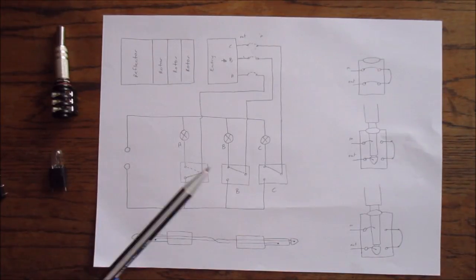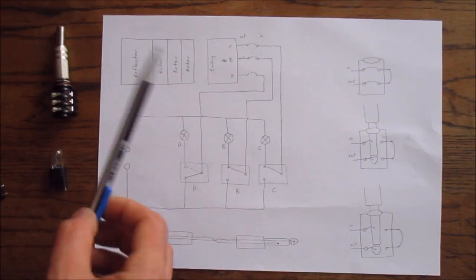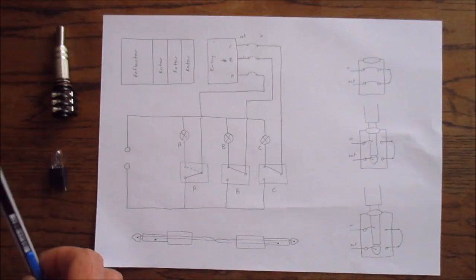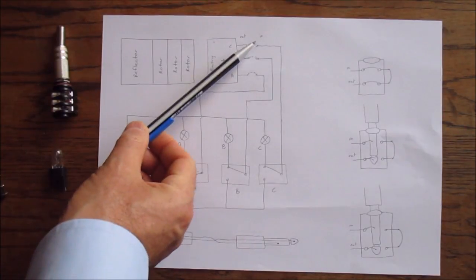Basically it's just a very simple battery, switch, and light bulb circuit. The actual circuitry is very straightforward — the wiring is complicated because you've got 26 letters, 26 keys, and 26 lamps, but fundamentally what it's doing is very simple.